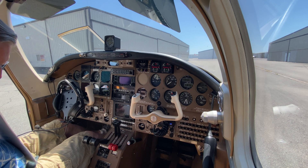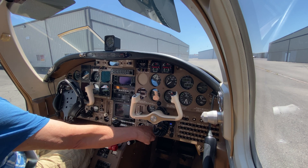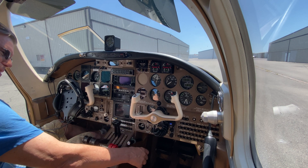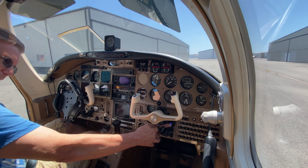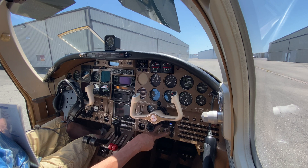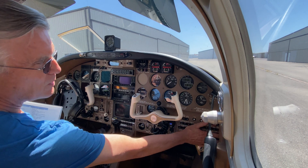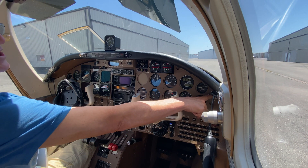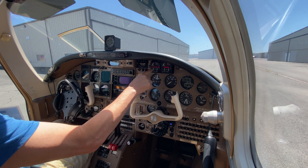Alternate air is closed. Come back up to the other side. Fuel on. Cross-feed on. Lights on. You can barely hear the cross-feed motor. Make sure the hydraulic valve is open. Voltage is good. The blower's off. Two heater knobs are in. Check the right side breakers. Hydraulic pressure's off. Air conditioning and fans off. Check the lights on the fire — it's on. That'll be a tone a little bit later on.